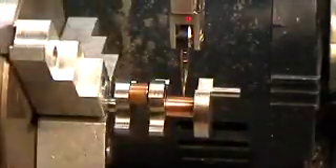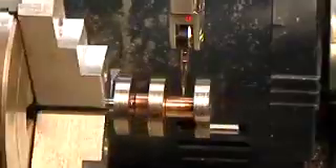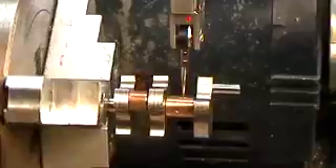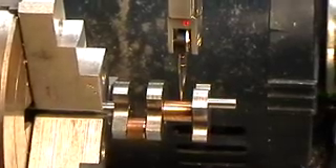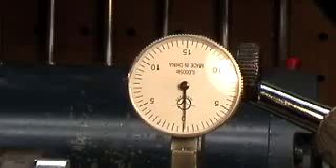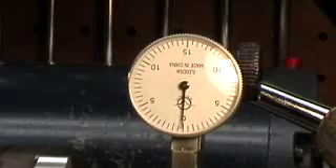You can see the finished crankshaft — the three crank discs which I showed you drilling. It's back in the lathe now for checking. The central hole was drilled on the lathe and I moved it to the mill to drill the crank pin holes. I'm checking for concentricity. It's actually worked out very well — it takes a little bit of trial and error and patience, and V-blocks are essential to start things off right. As I rotate, you can see on the dial test indicator there's just over half a thou runout, and I'm sure that will be okay.